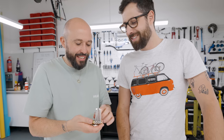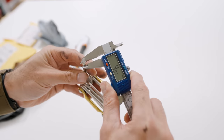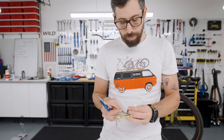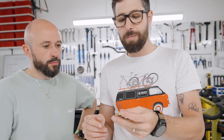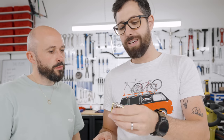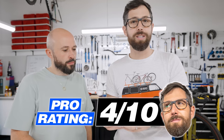It is not a very good product. Getting out the verniers on the Allen keys — that's supposed to be a 5mm key, and it's not even close: 4.8mm. I suppose it will still work, but eventually it's going to round bolts. It costs £3.74. If you're stuck in the middle of nowhere and that's the only thing you've got, yes — but I wouldn't pay for it. I'm giving it 4 out of 10.